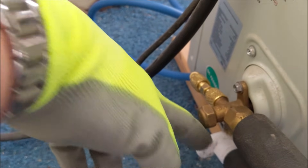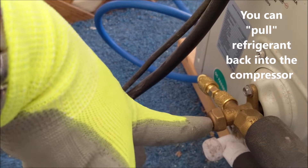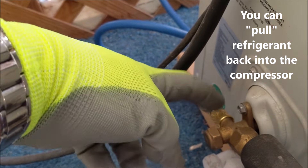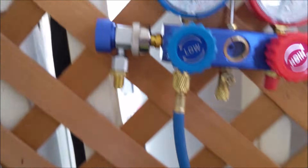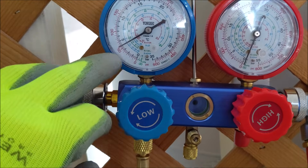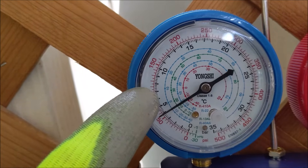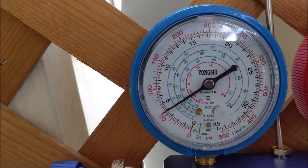Don't get confused with these two valves here — those are just to open and close when releasing refrigerant. Inside you'll see a space for an Allen wrench, but that's not what we're using here. The access port is the other one: if you remove the cap, inside there's a little pin that looks like a tire gauge — that's a Schrader valve — and that's where you connect your blue hose. The sweet spot for PSI is around 117 to 120.